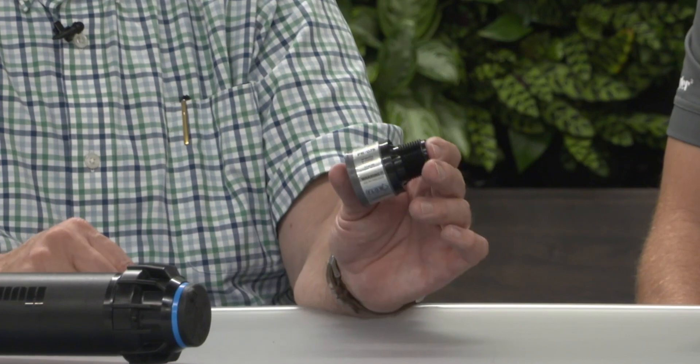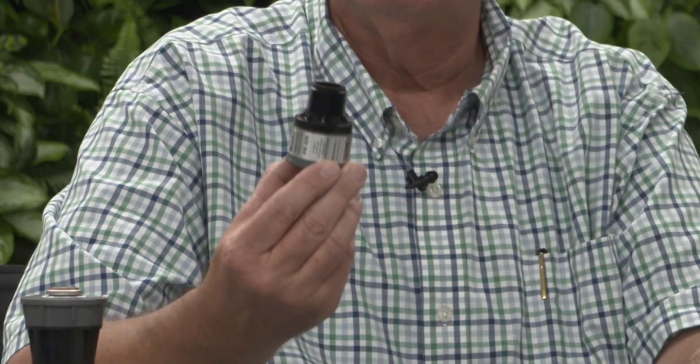On the new PR075 pressure-regulated module, you can go to the field and install it under the sprinkler. Many will say that adding it will raise the height of the sprinkler, but products tend to get a little too low in the turf over time and don't allow the sprinkler to pop up tall enough. By unscrewing the rotor and installing this one-and-a-quarter-inch taller male adapter underneath the sprinkler, you get a taller sprinkler at the correct height and the benefit of pressure regulation.